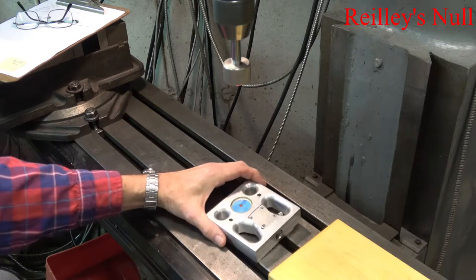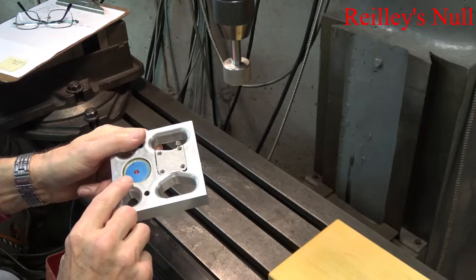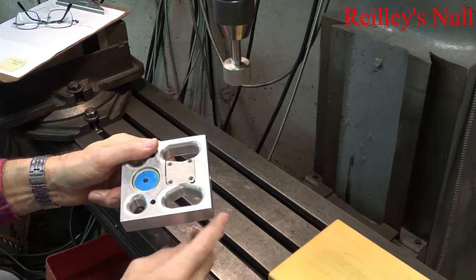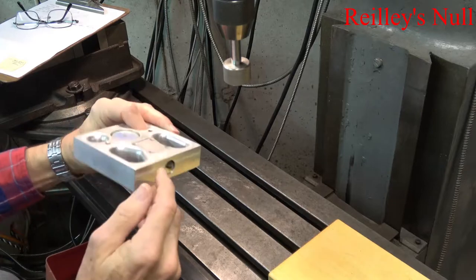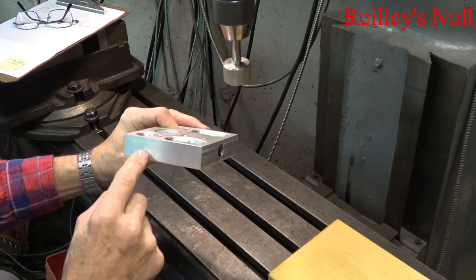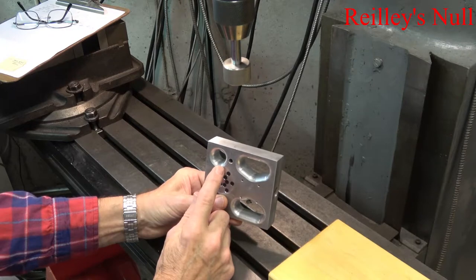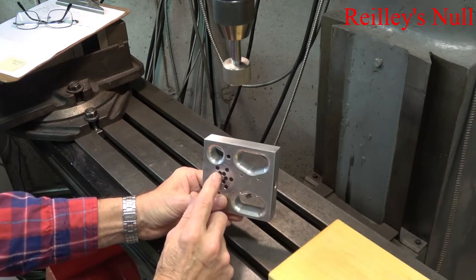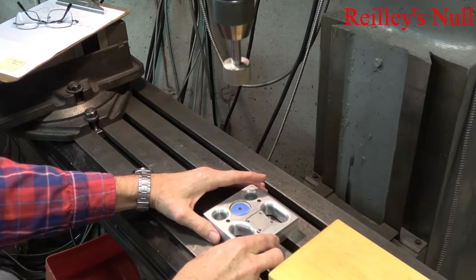This is a simple device. It has a mirror that is a partially reflecting mirror — actually a 90% reflecting mirror in the center of the dot that you see. The rest of the surface is fully reflective. Inside here there's a laser pointer. That shines along here, hits a mirror that is at 45 degrees, which directs the beam up to the center. The mirror is adjusted using this ring of screws. The inner ring of screws is used to adjust this 45-degree mirror. In that way, you calibrate this.